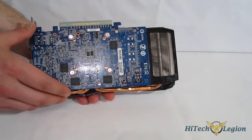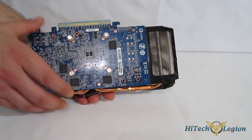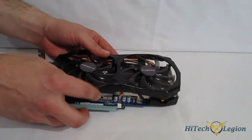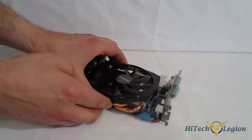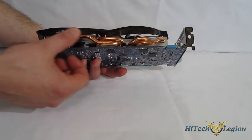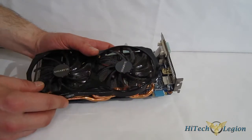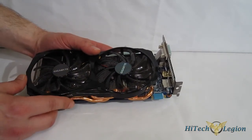It's going to run cooler with better power delivery and more stability, so you're going to be able to get a little bit more of a tweak out of it, and even at normal clock speeds you'll see a little bit more performance. Moving on, obviously this is not a reference cooler. This is GIGABYTE's WindForce 2. You've got two slim fans up top and four heat pipes over a really nice array of fins. These are ultra quiet fans that run much quieter and much cooler than the reference design.